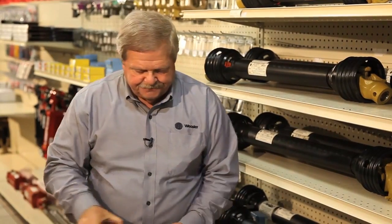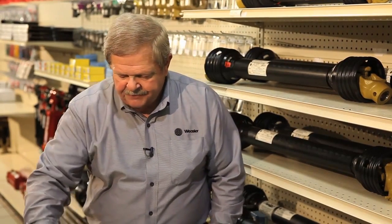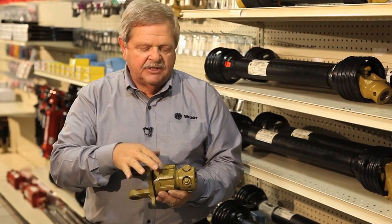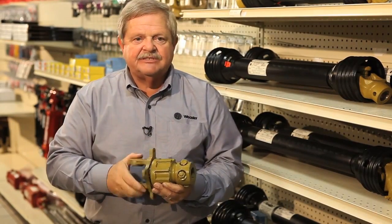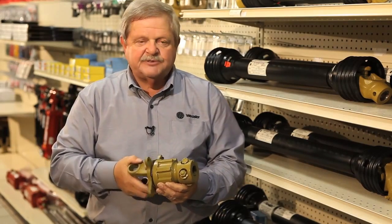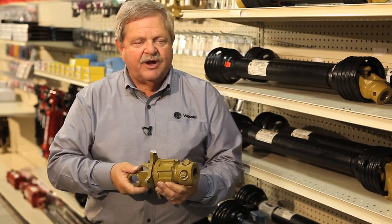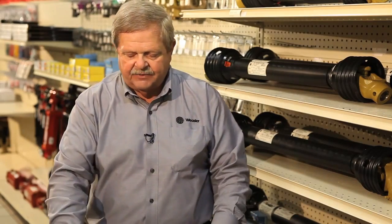The next thing I want to mention is on the TorqueMaster, we also have an overrunning clutch. If it has eight tabs in the center, it's actually an overrunning clutch. What it does is transmit power in one direction only. So when it's hooked up, it's only going to transmit in one direction, and if you shut something off, it gives it a rundown time so you don't take a clutch out on the inside of the tractor.